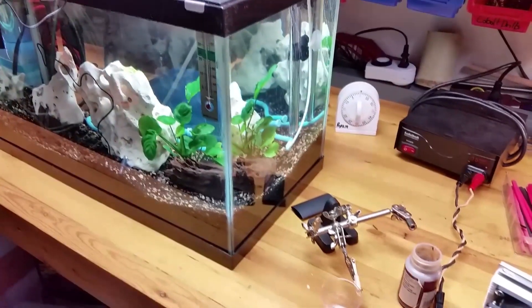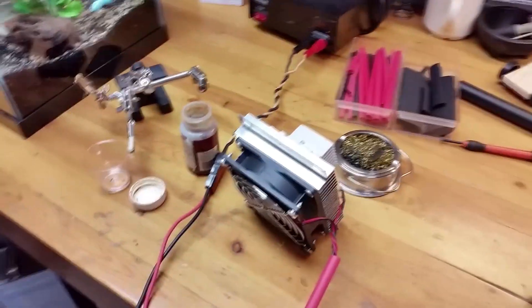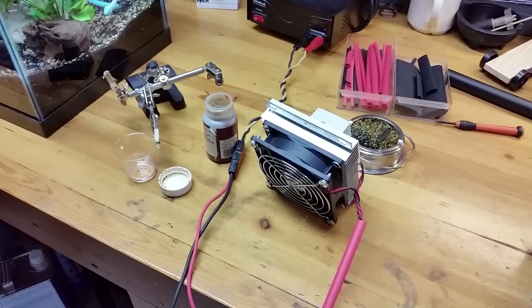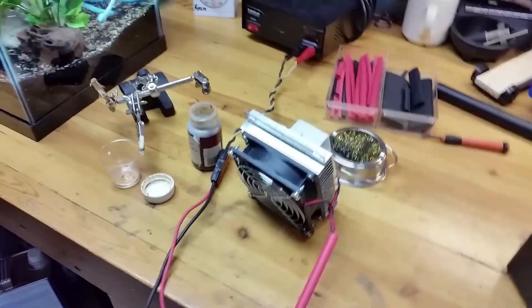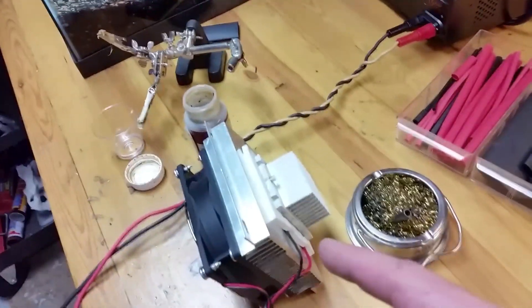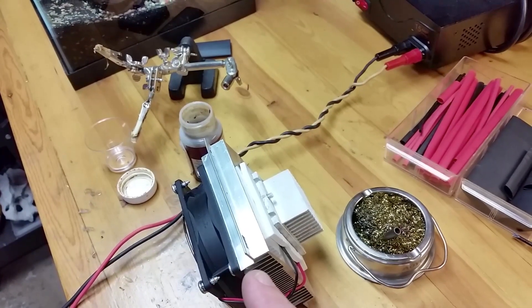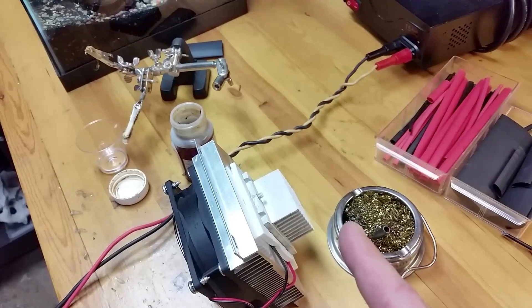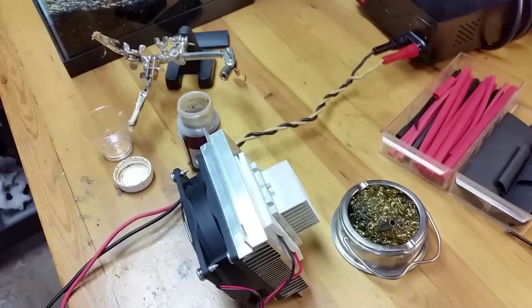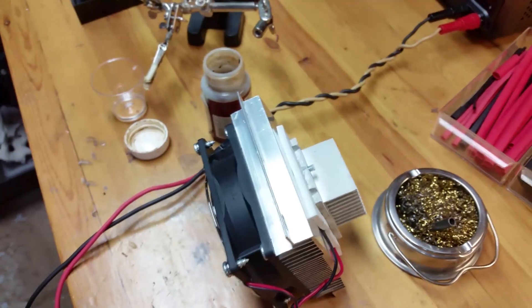Of course, we don't need a heater in the aquarium, but we need a chiller. Chillers are very expensive for aquarium use — a lot of saltwater users use chillers. This is a Peltier junction. The junction is right here. Put 12 volts across the junction: one side of the junction emits heat, the other side cools off. It's chilled. You can see this heat sink here is frosted over already.